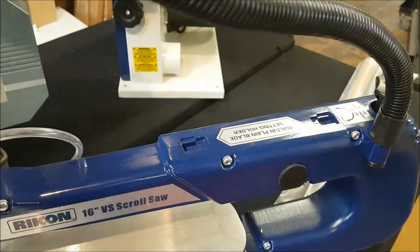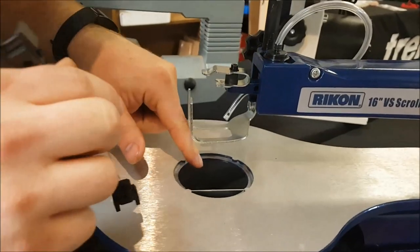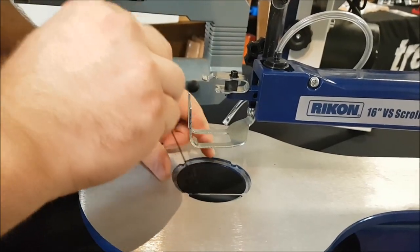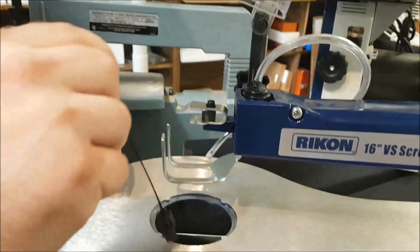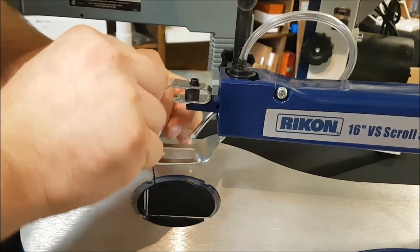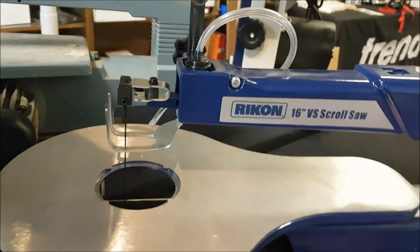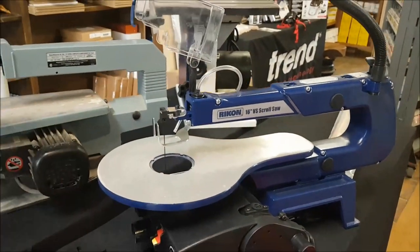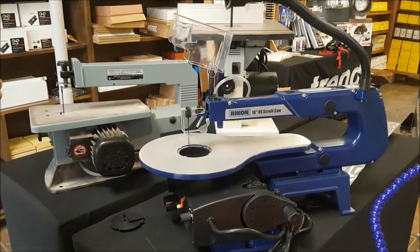Compared to the little Delta, it's kind of nice because you've got this great big hole so you can see what you're doing. This little bar on the back will hook onto the bottom clamp, and then same thing on the top — just like that — and then you tighten it up at the back. One thing about both these saws and with pinned blades in general is you have to re-tighten it every time to get your tension.